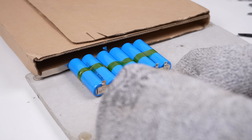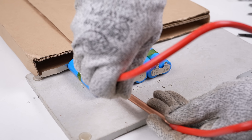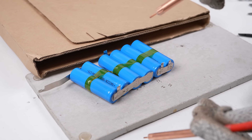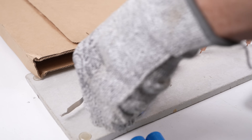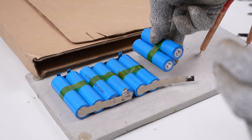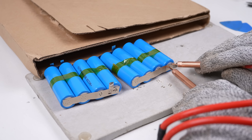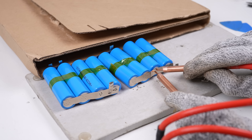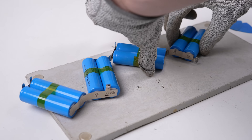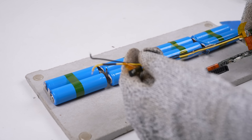Just when things were going well, I slipped with the welder, creating a fair spark and skid mark across the nickel strip. My welder fires automatically, so you have to be precise and quite quick. This was physically awkward as the batteries tended to slide around when trying to weld. I really needed a jig, but I used some cardboard packaging instead, positioning it against the wall and propping the battery against it to weld the necessary joints.